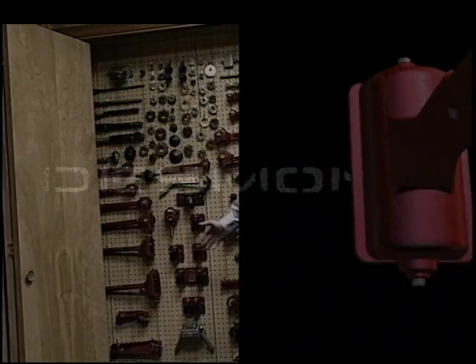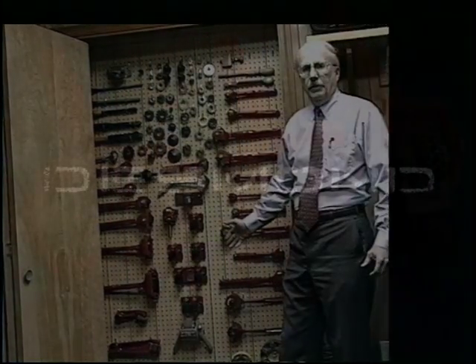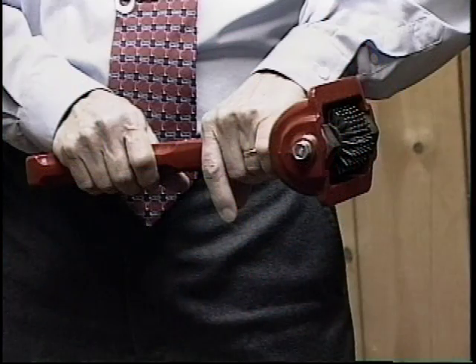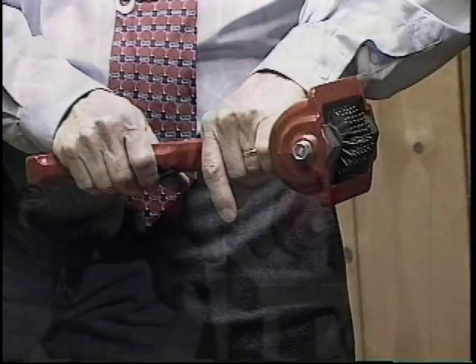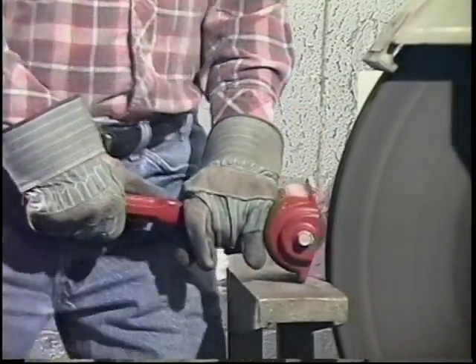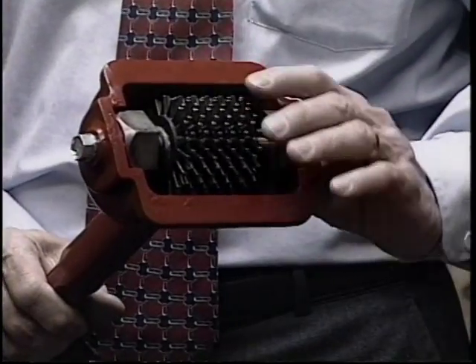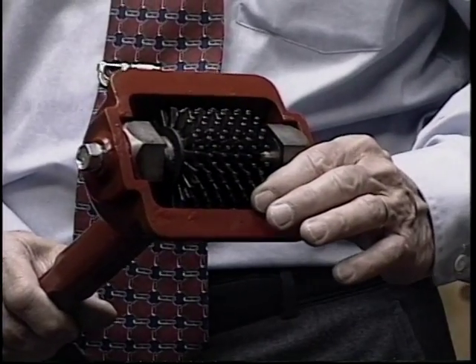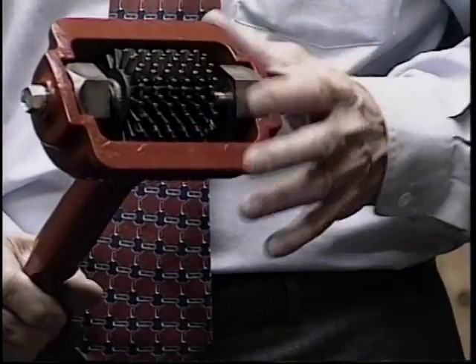As you can see from this dresser wall of fame, there are many kinds of grinding wheel dressers. Here are several sizes of Desmond heavy-duty dressers. These are used on snag grinding wheels to restore a like-new sharp cutting face. Heavy-duty dresser handles are designed to withstand heavy forces. The replaceable cutters are angled with an open-tooth design to rip the dead load from the face of the high-speed snagging wheels.